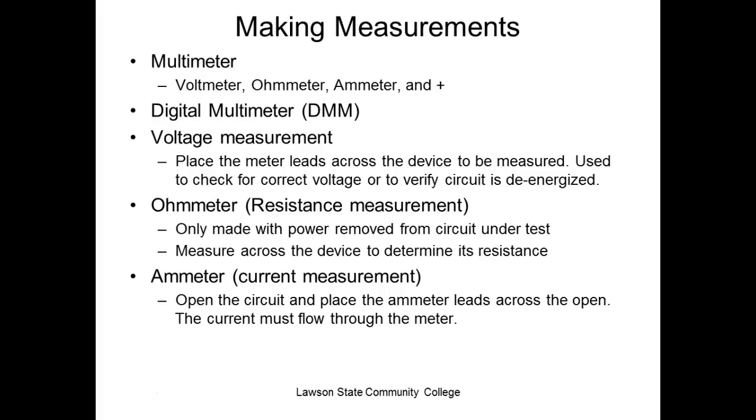Hydraulics, it depends on whether it's got what we call an accumulator on it or not. Some hydraulics have a big tank that has a huge weight or a big spring on it that when the hydraulic system is working, it fills that accumulator up. And then when you kill power, it develops pressure off that accumulator. What this does is it smooths out the whole system for varying loads. So you're out there moving actuators and it has a big demand. And instead of choosing a pump that meets my biggest demand, I can choose a pump that meets my average demand. Then if I exceed that average demand, it will feed off the accumulator, right? You understand? So it smooths out the hydraulic system.